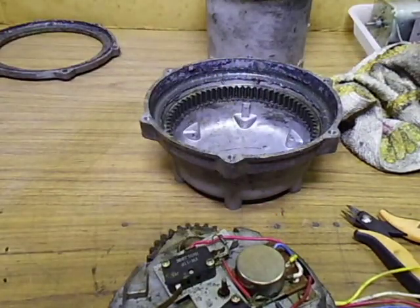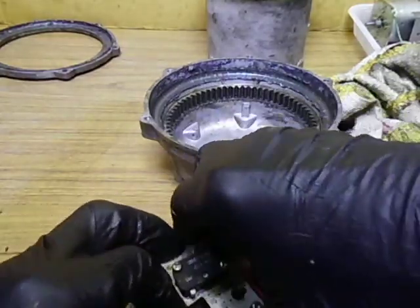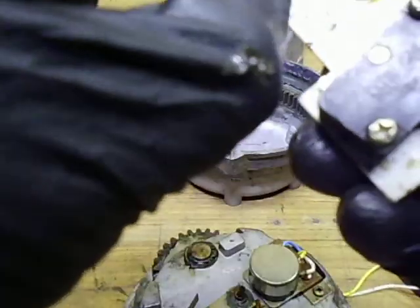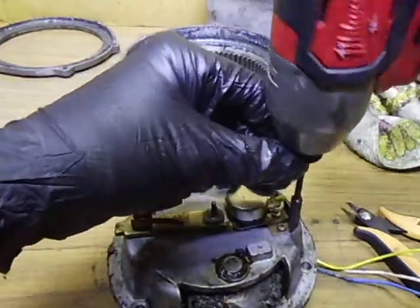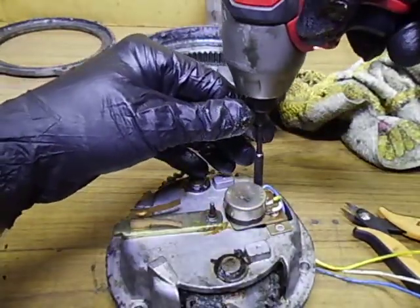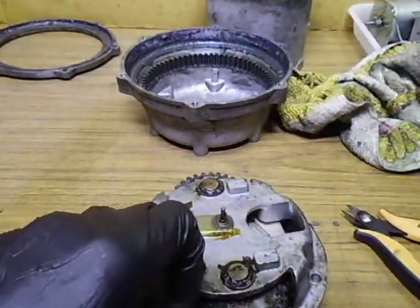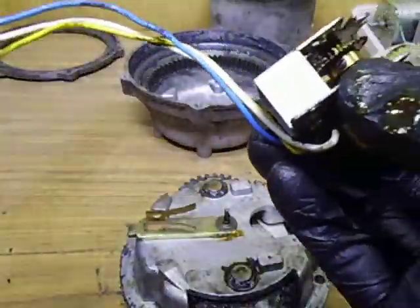It's like - get out of the road - it's been bent. Do the limit switches work okay? Not too bad. Let's get the potentiometer out. I suppose I should do a video of stripping down a potentiometer as well, because I can't buy their 600-ohm ones anymore and I have to refurbish them. I might do a video of stripping down one of these. That probably spins a little too free, and it's got a little more backlash in it.